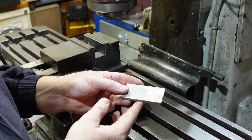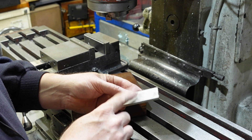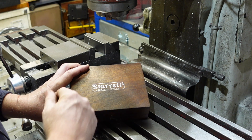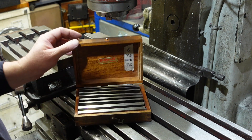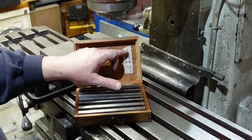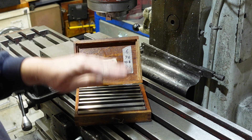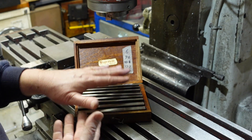I'm about to make up the latch that's used to hold the tap in. This is a bit of 5mm thick stainless and it needs to come down to 4.5mm. I've got a set of Starrett parallels here — they're actually made in Scotland. Inside I've got a list of the distances between the top of the vise and the top of the parallel. The tallest ones are 6mm between the vise jaw and the top of the parallel, so if I want to machine something less than 6mm thick, those are no good.